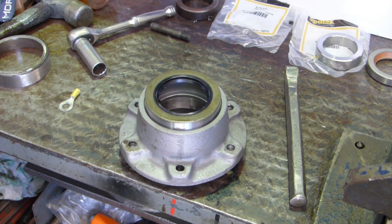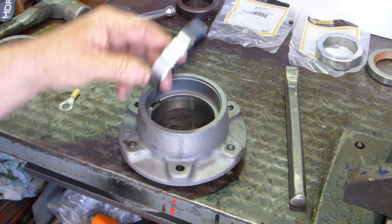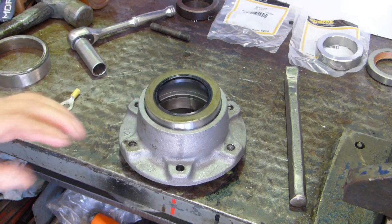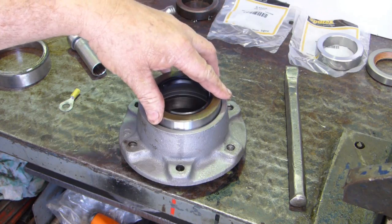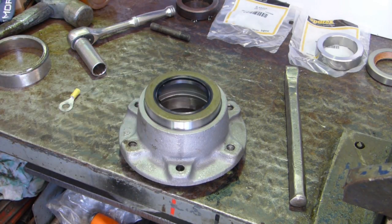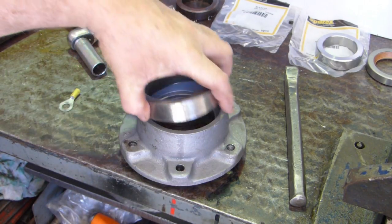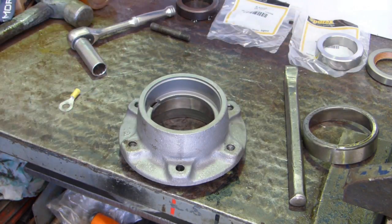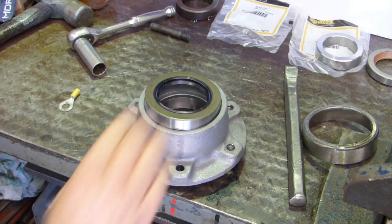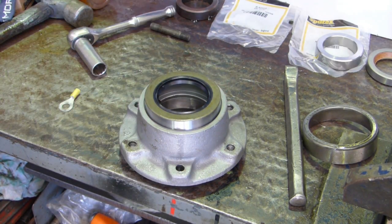If you're going to sleep better at night putting it on, put it on. It's one of those things, if it's not going to do any good, can it do any harm? It can't do any harm. But your silicon-based products, don't put them anywhere near your tractor. Use aviation cement or something like that. So I'll go and find a little bit of steel or something we can sit on there, and we'll try and bump that in. You can't use this anymore. See, that fella's too big. But I keep that. Now I've ground that one, I'll keep that over on the press. I have 35 ones there already, so we'll go and find a nice piece of round steel about the right size if we can, and we'll drive that seal home.